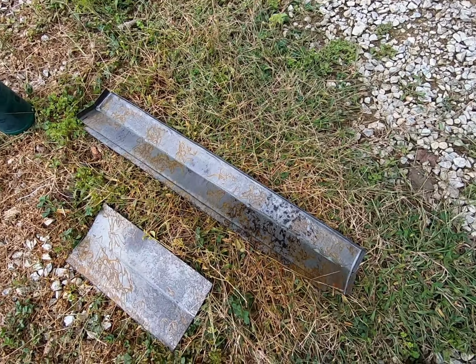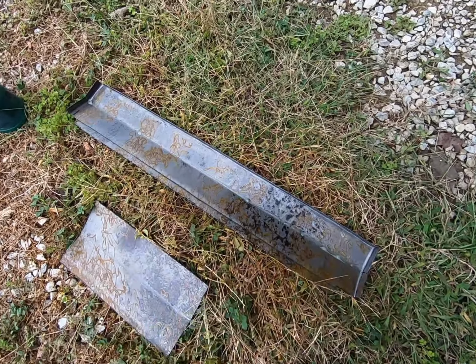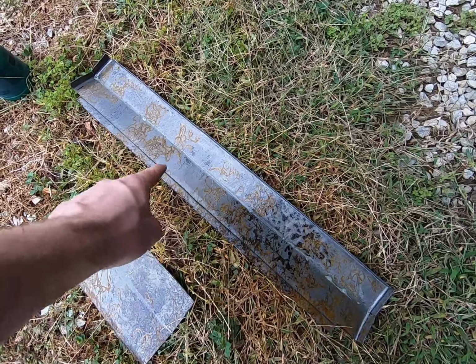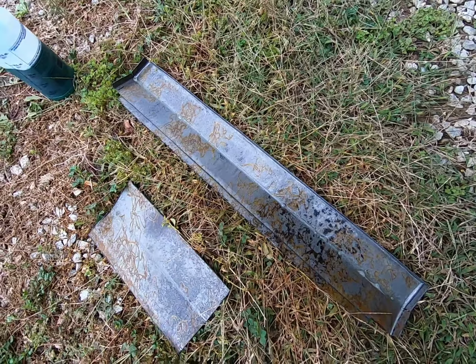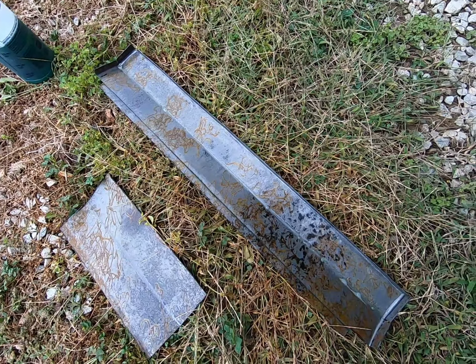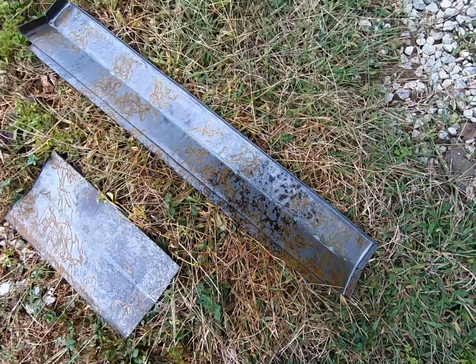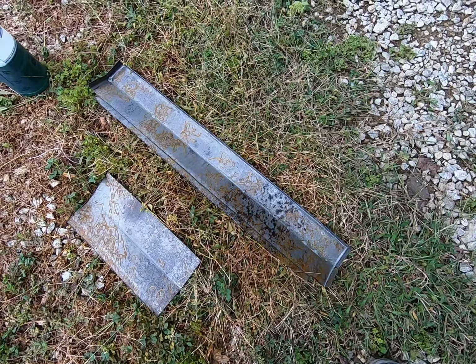Okay, so here's the back side of the piece that we just formed. I'm letting it soak in some phosphoric acid. Since this used to be a roof skin, it actually had some glue kind of strung on it where they put like the headliner insulation in. So we'll get all that off and get this little bit deeper rust out. Let that soak maybe for a day or so, then we'll put it on.